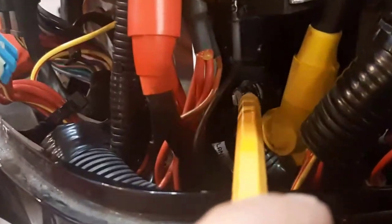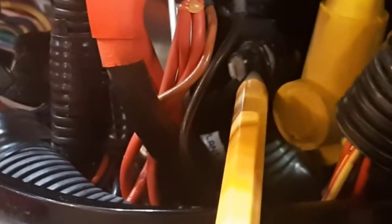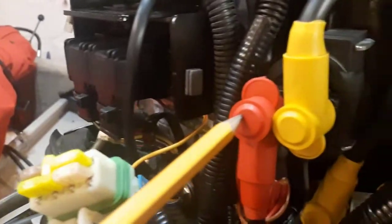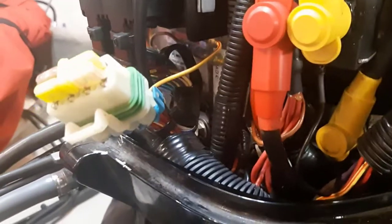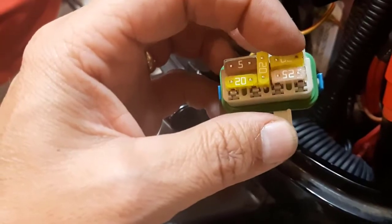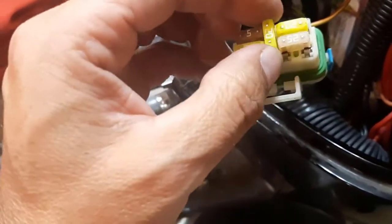To recap: there are four ground wires, all hooked up right here. On the positive side, up at the starter solenoid, there were three wires — all hooked up. The diode wire goes in behind the clamp like I mentioned. I also replaced a 20-amp fuse, and put a spare one in the middle, because you never know when you're out on the water.